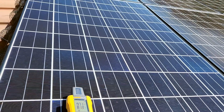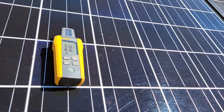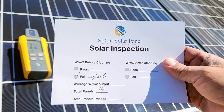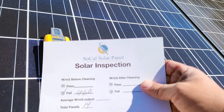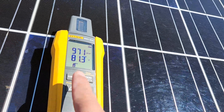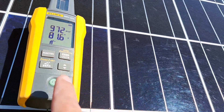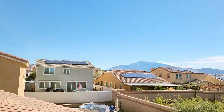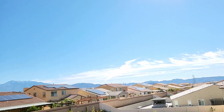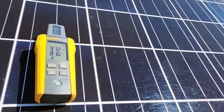This is how you check it after it rains — you can see the increase after we cleaned almost doubled. We were at 460 watts per square meter when we started, and now we can check this off as a pass at 971. The degree on the panel is going up because it's starting to get hotter, and as the sun — there's nothing blocking the sun, everything is pretty much blue skies over here and a little bit of clouds way over there — you've got the sun hitting the panels very nicely.